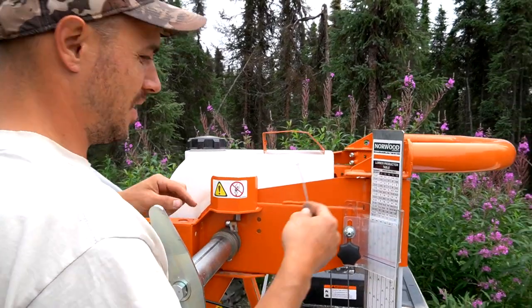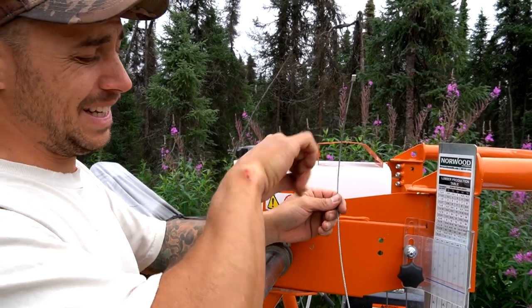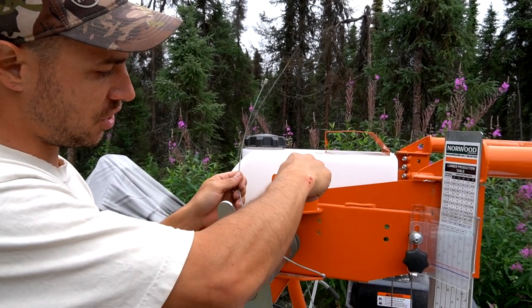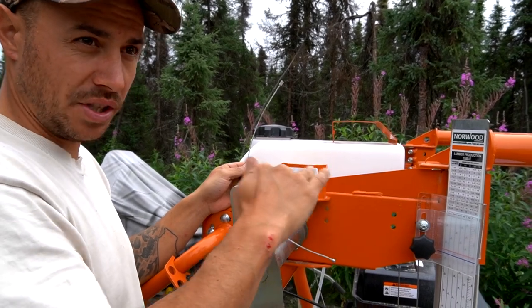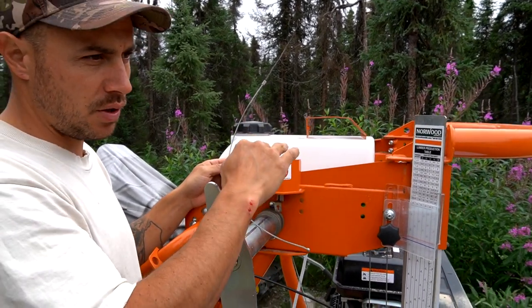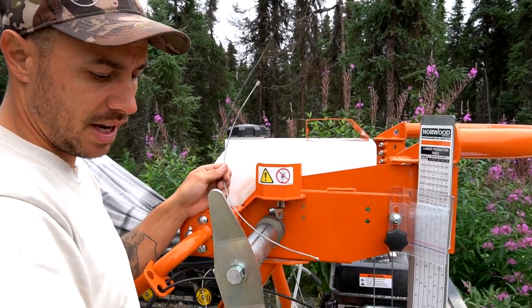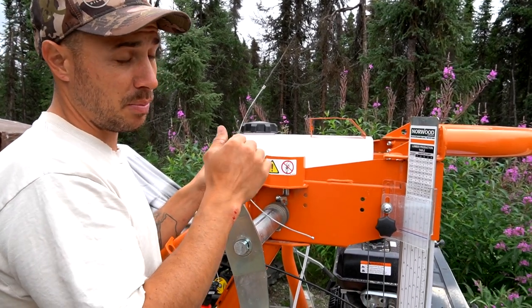Broke the sawmill. This little piece caught me in the wrist. So luckily, that's all it was. What this does is it's got like this little tensioner, and this holds the saw head kind of steady where you're making your cut. And when we first ran the sawmill, I noticed on one of my first cuts that the saw head, when I was going through the cut, was slowly drifting down. So this wasn't tight enough. So I tightened it up and it's been pretty stiff.